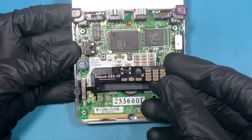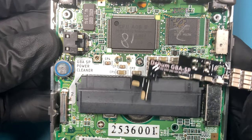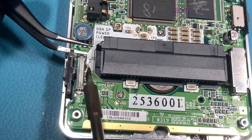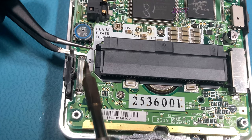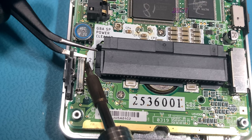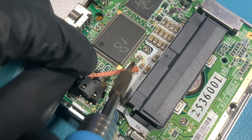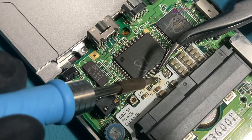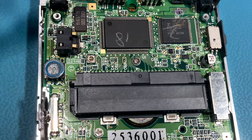I actually have the Helder version still in place and it looks extremely similar to the Retro 6 version, so I doubt there's any difference, but there's only one way to check - let's desolder the Helder version. To do that I'm just going to apply solder and iron onto the joints and then carefully lift up the flex PCB until it breaks contact. I'll also use some solder braid to remove some of the solder. Now we can simply lift up the Helder version and insert the Retro 6 version.